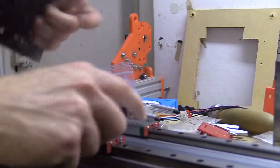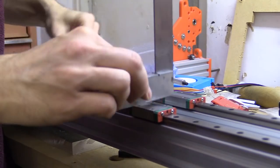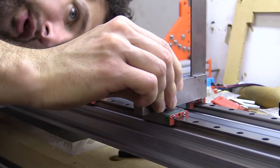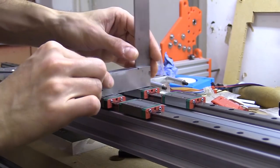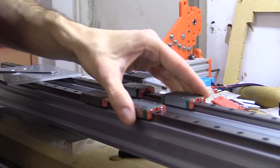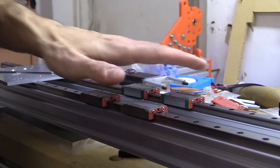The other thing I've just realised as well, grab a straight edge on one of the squares and push that down on one side. I can see that these are not lining up properly. Carpenters use winding sticks to do a similar thing on boards, and I should have used this method earlier to identify any major twists before assembling a good deal of the machine.